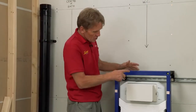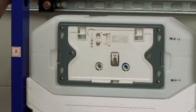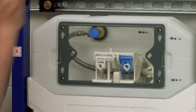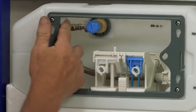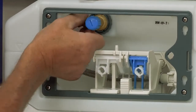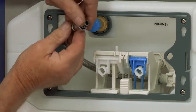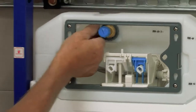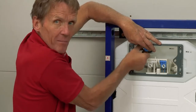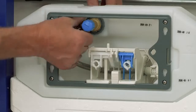The supply to the fill valve runs round on a flexible hose and is isolated there. If you want to change it to go through the top, just take the connection off and take the valve out and put it through the top. When you put it back, there's an O-ring to seal it — no paste needed, the O-ring does the job. Just make sure it's turned up and tightened; no need for a large wrench. The O-ring is doing the sealing.